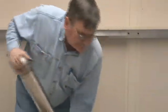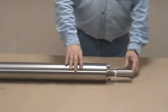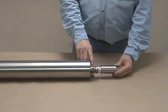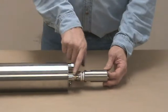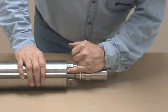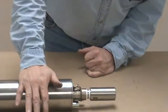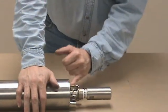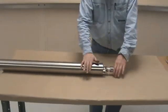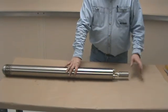With the landfill pump, we have fitting kits for the tubing that you have on site. There is also Teflon tape and hose clamps in the kit, so you would put the appropriate sizes. The A engraved in the top of the pump is your air supply; E is for exhaust. If you have questions about this particular pump, you'll want the serial numbers on the top of the pump. This is the discharge check valve. Once you install your hose barbs and attach your hoses, you're ready to install the pump.